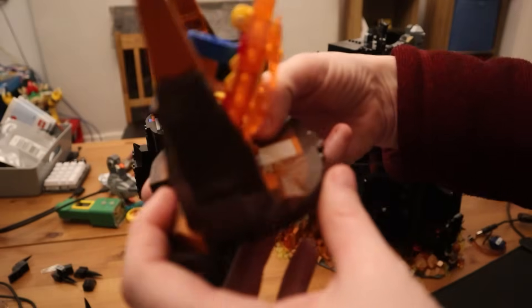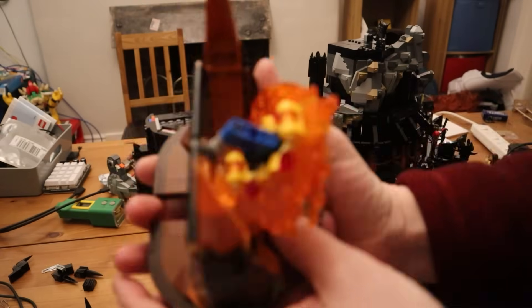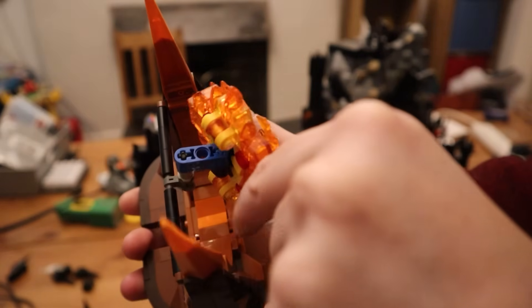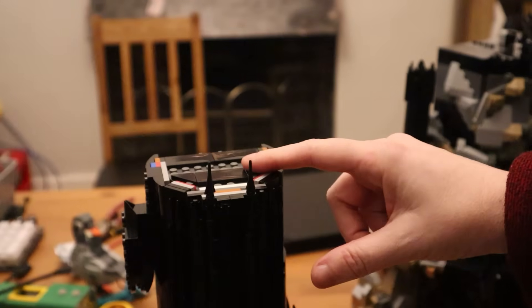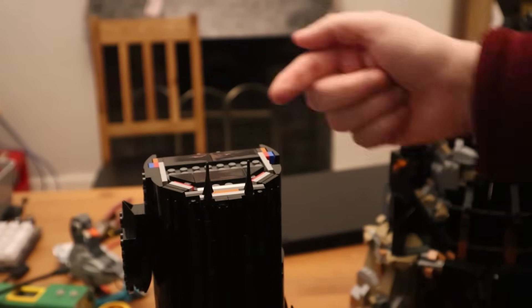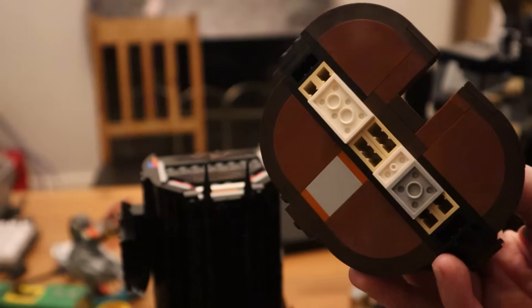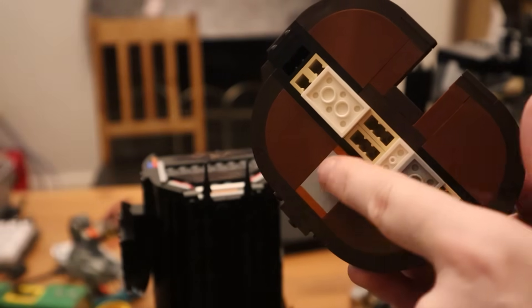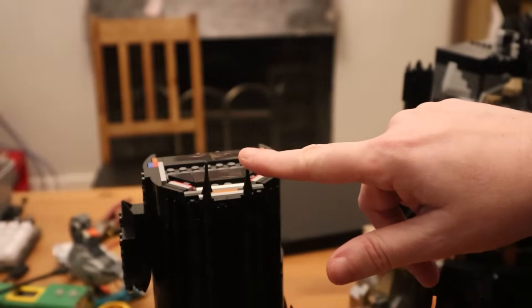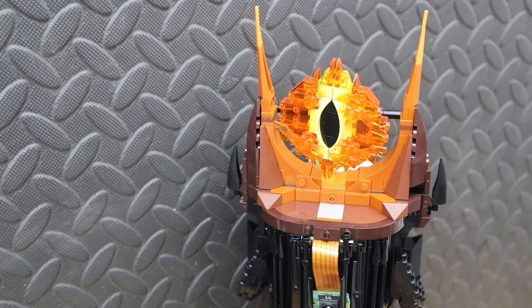With the tower, I've taken off the very top piece and added some extra pieces, so now it does turn right and left much more easily. On the top here we're going to feed the camera through so it sits at the front. I've created some space with a layer so the camera cable runs through without getting squished, sitting between the two spikes. Here's the eye from the front — I'm really happy because the Pi is on this and you cannot see it at all.